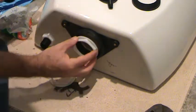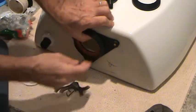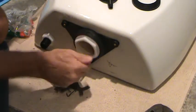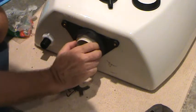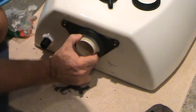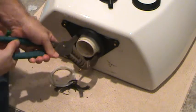Once it's out of here, I can't tighten that nut up enough. But can you see — if I had this washer here and put it in there first like that, then when I put the nut on and get it down there, as this tightens up, instead of grabbing the rubber gasket and moving it out of position, this plastic nut is sliding on that washer. That's the only reason that washer is in there — it keeps the backing from puckering and gives it a solid surface.